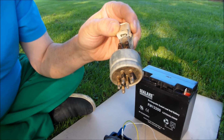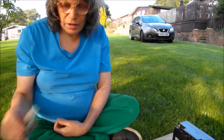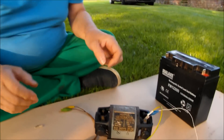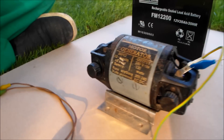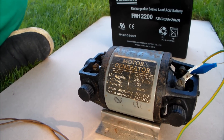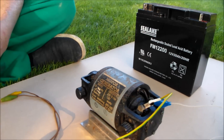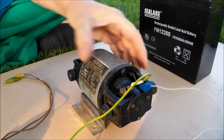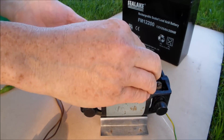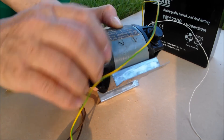Another means by which you could generate a higher voltage is with these things. This is called a motor generator — they've also been described as rotary transformers. What would happen is that you would supply the 12 volts on this side, which is effectively the primary, and you take your HT — in this particular instance, 250 volts — from the secondary.